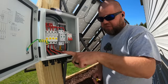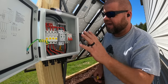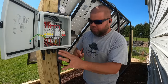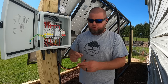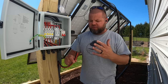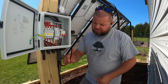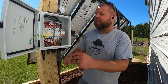I'll tell you in just a little bit why I specifically chose this one, even though it costs a little more over some other models. I have my wires coming here from my solar array. I'm not permanently mounting some of this stuff today, although I'm protecting it with loom tube. Because I run a review channel and test lots of different equipment, I need to be able to constantly unplug and change things up. I need to put some MC4 connectors on the end of this wire since I just cut it in half. I purchased some rated for up to 30 amps — I'm currently only running a 10 amp setup here. I need to strip this wire back and get these on — you can plug into the bottom right here.